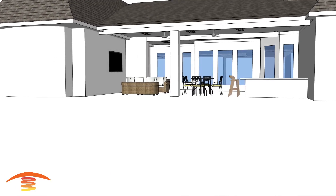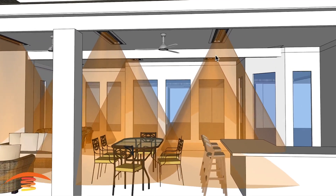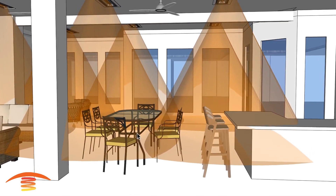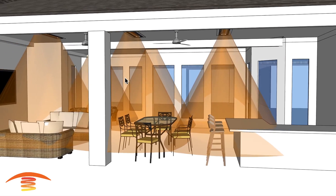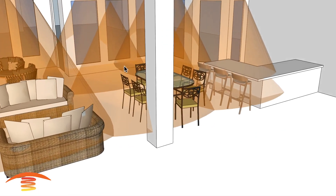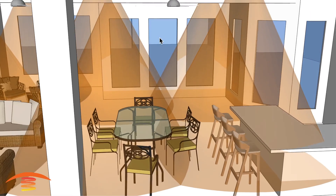Let's look at the footprint of heat you would get with this application. These are all 6,000-watt units, and a 6,000-watt unit would probably be too hot the majority of times for bar stool seating height because you're sitting about one foot higher than normal seating height — you're one foot closer and the intensity is a little hotter. I would definitely either use controls on all six units or reduce this to a 4,000-watt unit with a single element above the bar stool seating area. I'm not sure how this space is going to be utilized — maybe the table belongs over there — but you may or may not wish to have these additional two units over here.